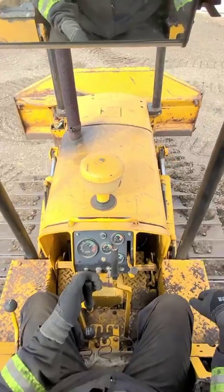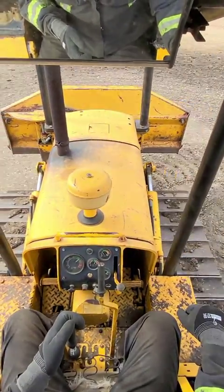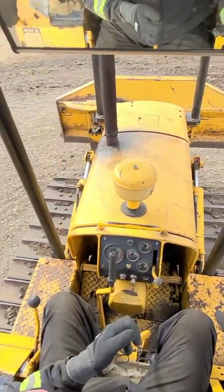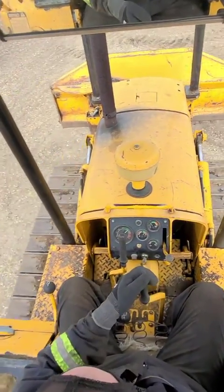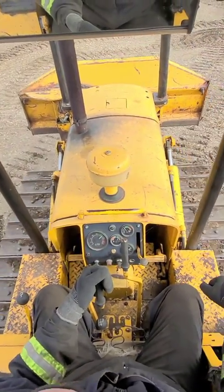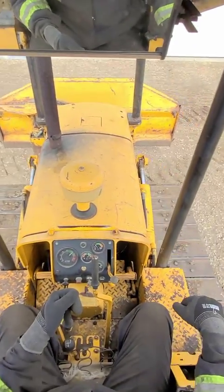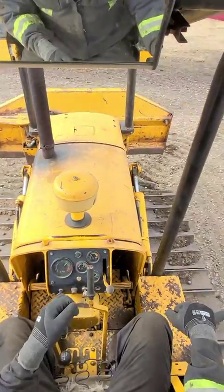Here I'm going to show you that you have some brake modulation. Braking to the left — there's a full pivot turn, as sharp as the crawler can turn. Full pivot turn to the right. The brakes seem to be holding. Now let's see if I can modulate them — yes, I can, having the right track just slowly drag. They're not simply on and off; I can control them. So I have brake modulation everywhere from no brakes to full brakes.